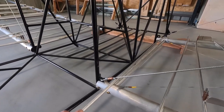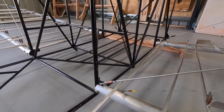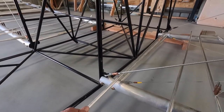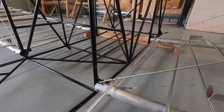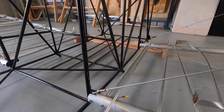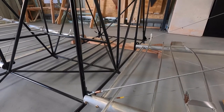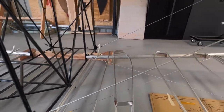The flying wire goes to the trailing edge, so I don't want the flying wire rubbing on the wing too much. It depends on how high the rib sits up with my jig — I might be able to tuck it in under there. Pretty much it's going to follow the inboard compression strut. If I have it too far in, the covering is going to wrap around that compression strut as well. There's not much information on this so I'm looking at photos and fast-forwarding videos trying to pause a blurred image in the background. Enough whinging — let's just build this thing.